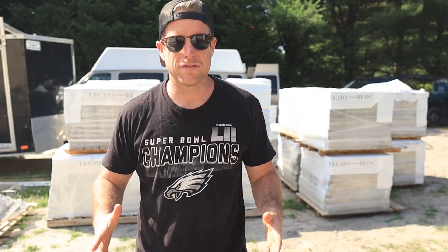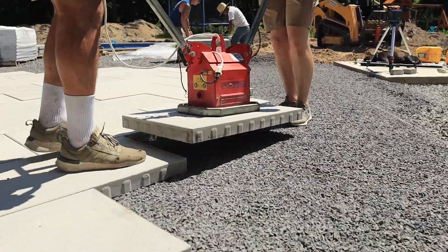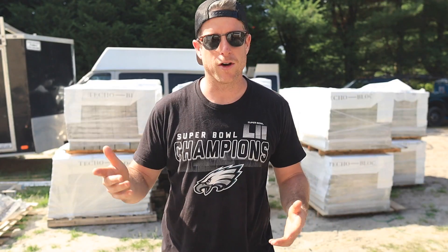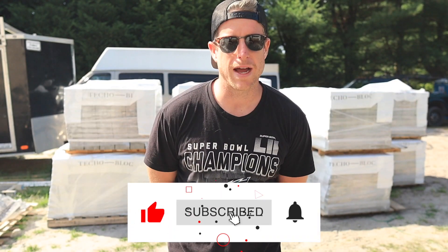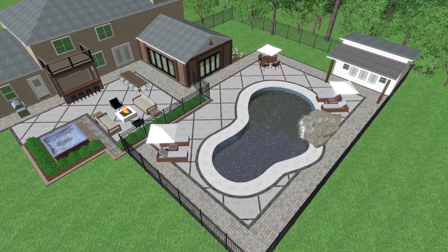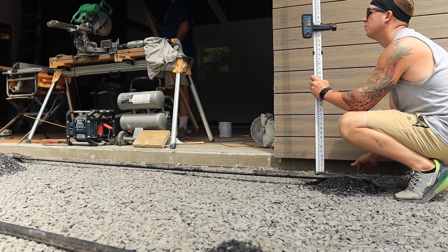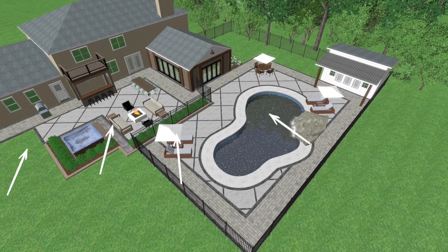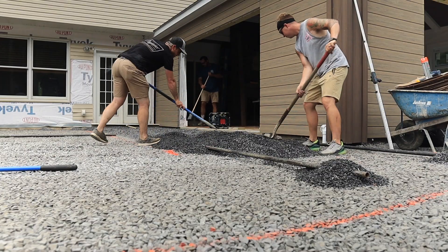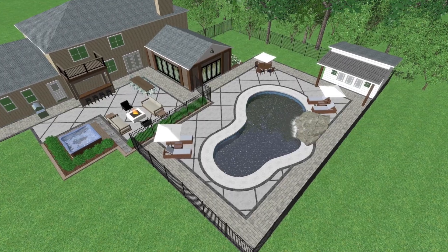What's going on everybody, welcome back to the vlog. This week we're gonna start on our paver patio — we're gonna be slinging slabs and dealing with some unfortunate issues along the way. Here's the plan: we're gonna start with the accent strip closest to the house so we can work our way out of that corner. Setting our screed pipe elevation will be a breeze because all the elevations at each door are the same. We're gonna work our screed bed in sections — lay the pavers, move on, screed some more.